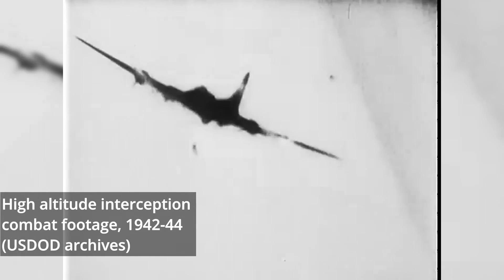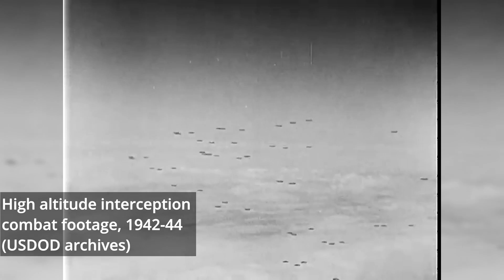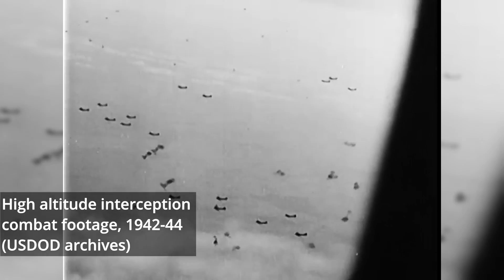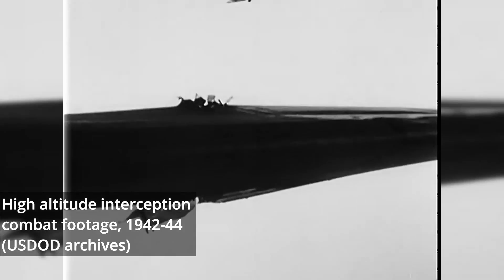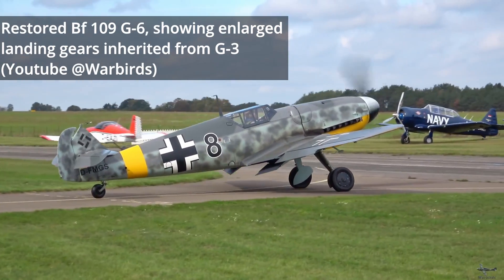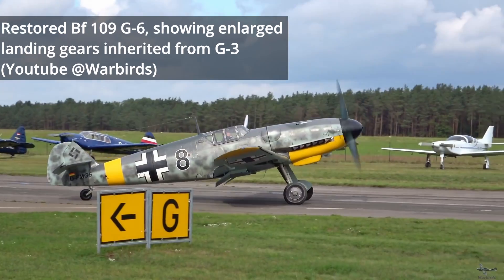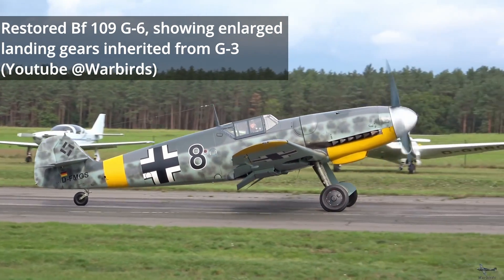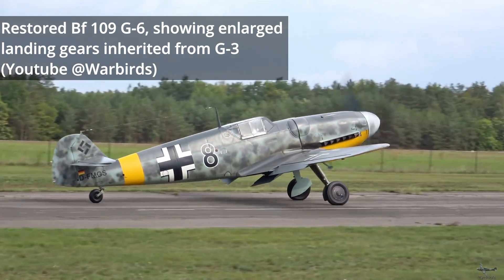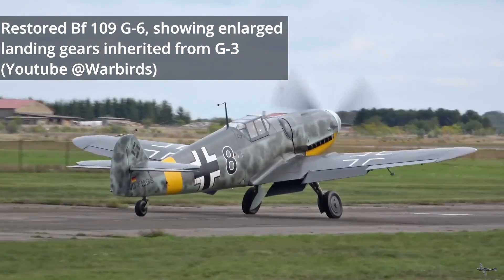In spite of the debacle of getting the DB-605A into service, improvements were slowly being made. Chrome-plated exhaust valves added much-needed durability and corrosion resistance, and a series of improvements to oil circulation would fix most of the engine's most serious problems. The restrictions would finally be released by the autumn of 1943, over a year after the aircraft first entered service. At the beginning of the year, the BF-109G-3 had superseded its predecessor on the production line. Its largest differences, apart from engine improvements, were its larger tires, small bulges added to the top of the wing to accommodate the enlarged landing gear, and a larger non-retractable tailwheel contributing considerable drag. These changes gave the aircraft better ground handling and allowed it to better operate out of rough airfields on the Eastern Front and the Mediterranean.